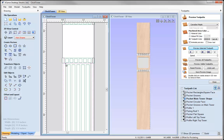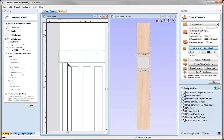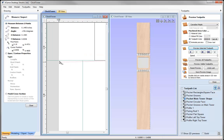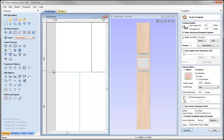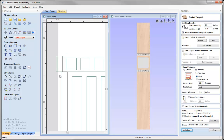We have got another step shape here. We need to check the measurement between this corner and the end of our material block. Using the measure tool, snapping to that point and going to the end, we are at 0.15 inches. Let's check that — we are cutting down 0.15. That is again to ensure that we create a nice outline of our tower for when we machine each side and come to turn it over.